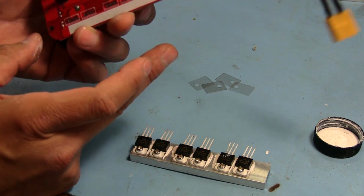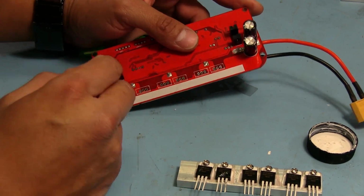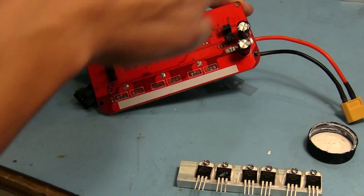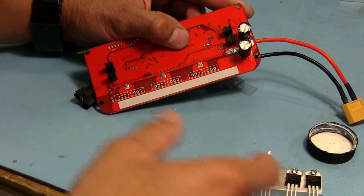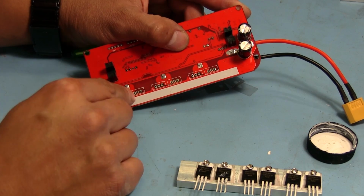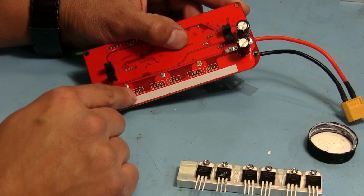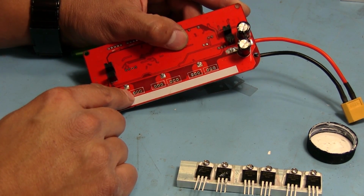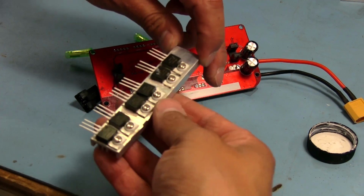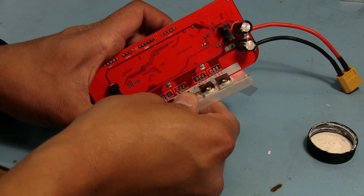So, all right, one more shot. Okay, third time's a charm, right? So I cleaned that one out and it actually turns out that the one over here at the end also looked like it still had a tiny bit, like a layer around the inside of the hole, which was probably going to prevent that last one from going in very well. And one of the ones over here on the far left side also had a little too much solder in there. So I cleaned that one out too, and I think that's why it was a little more difficult, except this one wasn't bending, so it was still going through. It was just providing a little bit of resistance for the pin to go in. So now this should be easier, but let's see.